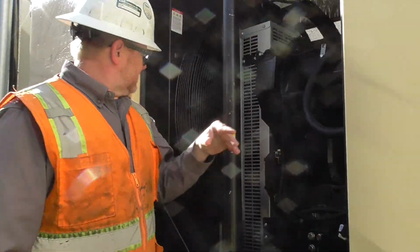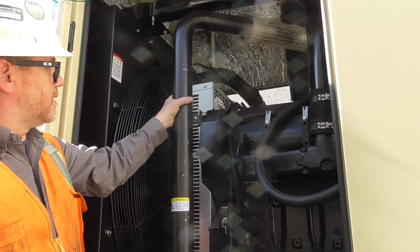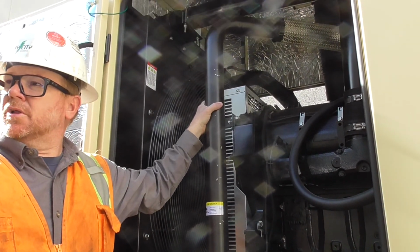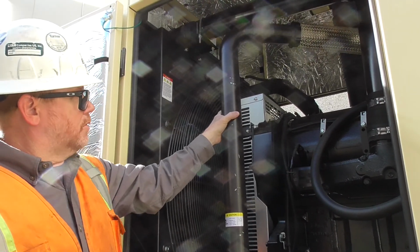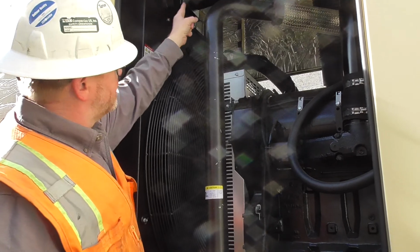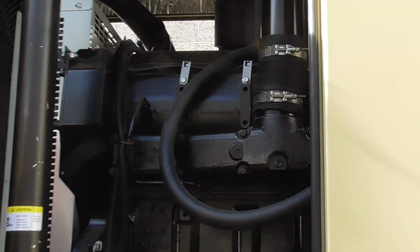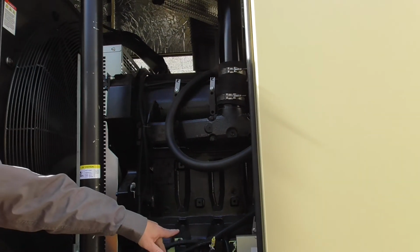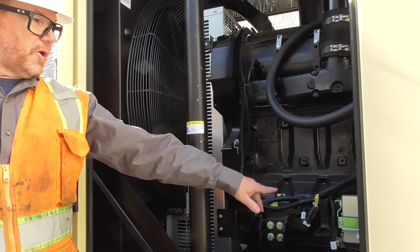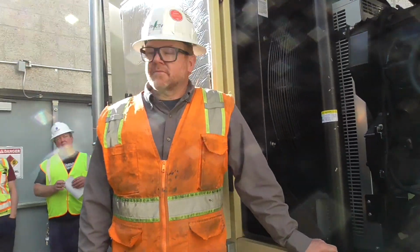Air intake, like I said, this has an intercooler, which is located here. These are all air lines. Okay, these are not coolant lines, these are air lines. So when it comes in through the turbo, it goes down, comes out the top, and back into the intake here. This is ECM controlled. This does have a computer for its brain, so everything is controlled through there.